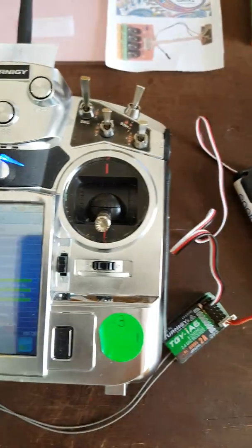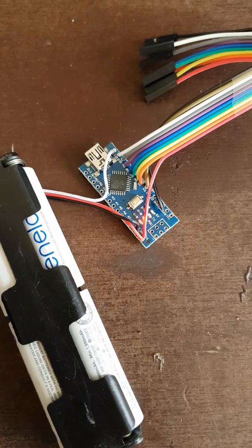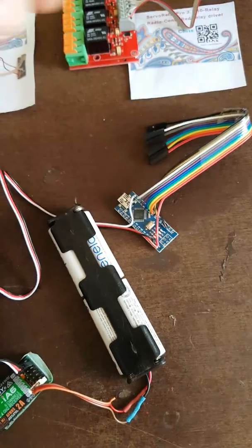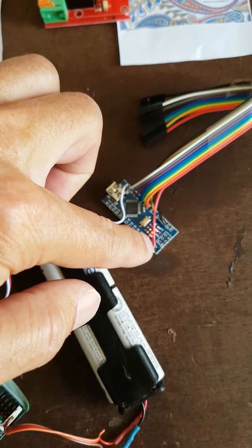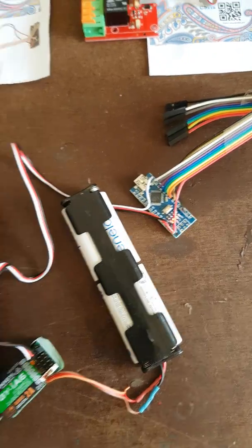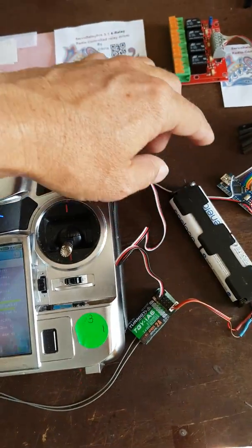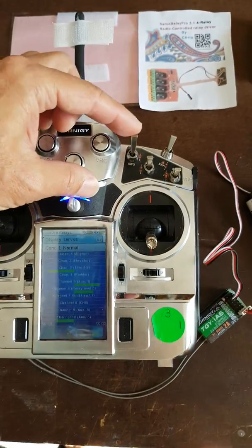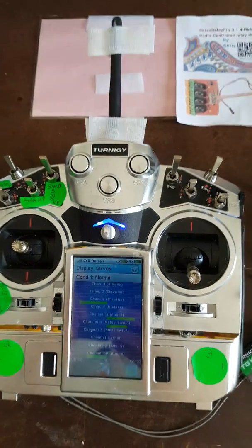That's how to do it. I'll put on relay number one again — you'll see it's blinking like crazy while it has a signal, then it settles to blinking once for relay one. If hooked up to the relays it uses these pins to fire. You can also wire pin 13 with a resistor to an LED to indicate which relay is selected from a distance. If you wanted to select a relay and then activate it separately, you could put a second relay into the earth on all the relays and use another button for activation, so one switch is select and one is activate. Enjoy!